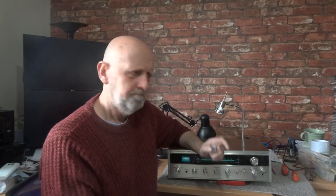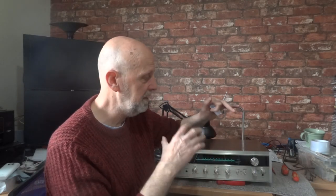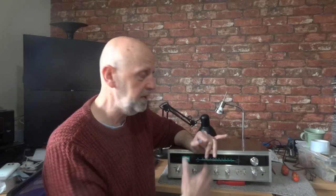The only other thing to do is to swap out the matching transistor on the other channel to match the gain levels between the two channels. Going further, I'll be replacing all the 2SC1344 transistors as they may be prone to leaking and making noise later on, and also replacing the capacitors in this unit — I've already bought all the parts. That's going to be another video. I'll do a before-and-after sound test to show the difference the recap and transistor replacement makes. Be careful when working on these units, thanks for watching, and I'll see you all soon.